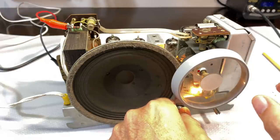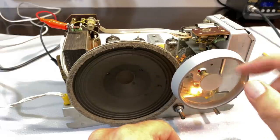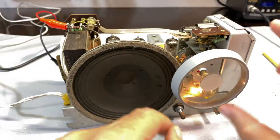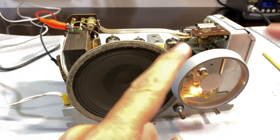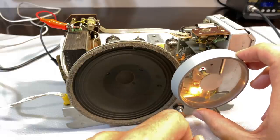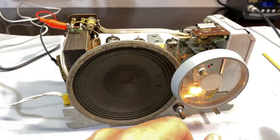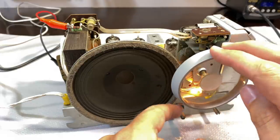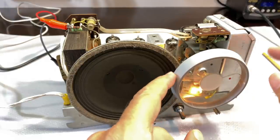If I've got one observation to make with this broken dial, this is pretty sensitive. There's no gearing on this, so you do have some diameter here, which dampens the effect of the turn, in other words the gearing to the tuning condenser, but it's pretty sensitive. And it's not as easy to tune as some of the other ones that have the dial cords going through multiple pulleys and gearing it all down. You literally have one turn. This thing's over here. When you turn it over, it's over there and the capacitor's been fully meshed.